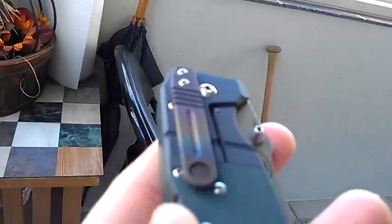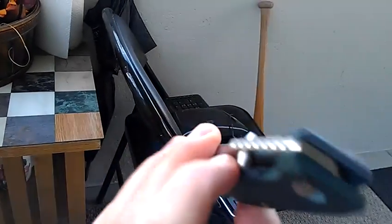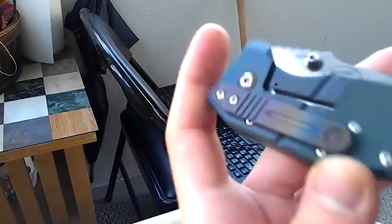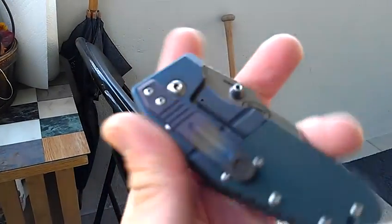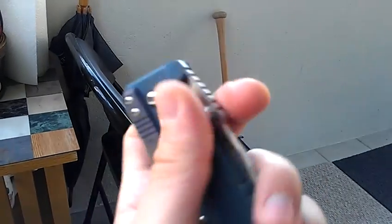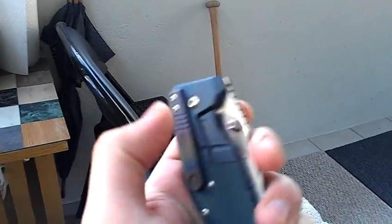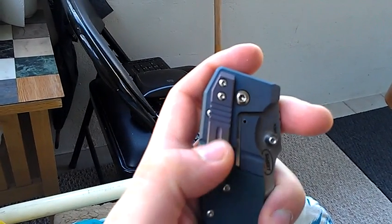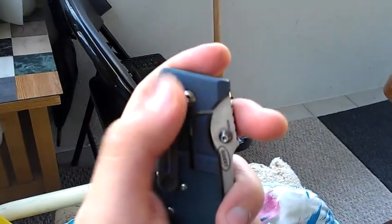This is what came out at the end — I made mine blue, all the way through, with some purple because I layered it. Three batteries got me the blue on the pocket clip, but three batteries did not get the blue on the larger titanium piece. So I went up to four, then five — five was the perfect number of batteries to get the blue. From there I layered: three, four, five, six, seven, eight, nine, ten — nine and ten pretty much turned out the same, that lavender color at the top.